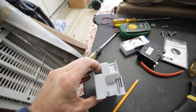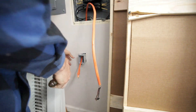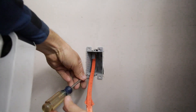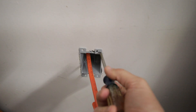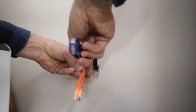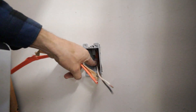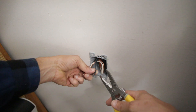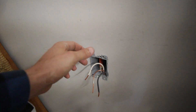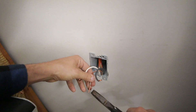I poke a little hole in the junction box to get the wire through, slide the wire through the junction box, and push the box back into the hole. Then I can just snug it into place. This junction box works by having wings that flare out when you screw it in, and it kind of pinches it to the drywall, making it nice and snug. Now that it's in there, I went ahead and stripped the Romex sheathing very carefully using a razor to score down the middle lightly, then peeled off that insulation, exposing the wires. I strip about three quarters of an inch on both the white and black wires, then put loops in all the wires to make it a little bit easier to attach to the plug.